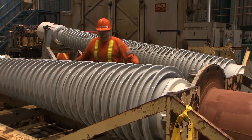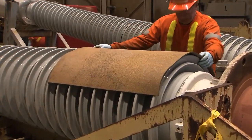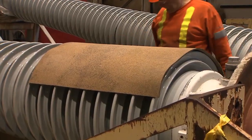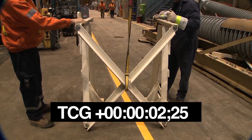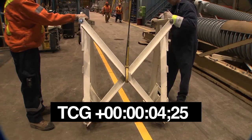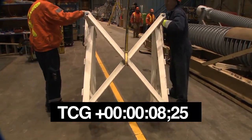Place a sheet of cork padding over the porcelain just above the mounting flange to protect the porcelain from directly contacting the lifting jig when it is attached. Loop one end of a lifting sling with the appropriate weight rating capacity around the junction of the remaining crossmember on the lifting jig.